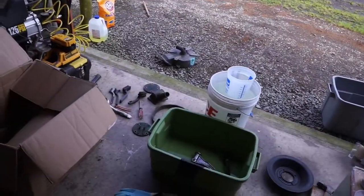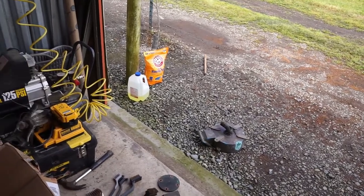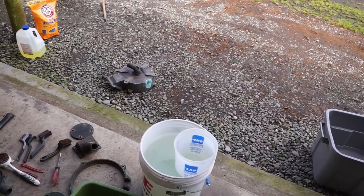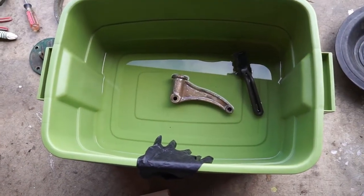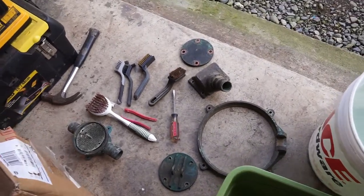So what we decided to do is use a weak acid — we have muriatic acid over there, it's just pool acid that you get, it's 14.5%. We've diluted that a lot — this is like an 8-to-1 mixture in this bucket right here. I just needed a little test run on this piece, which is a control arm. It looks like it's cleaning up okay. You can see a lot of the stuff we need to clean is all corroded.